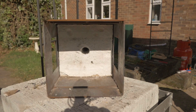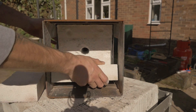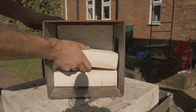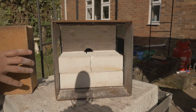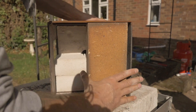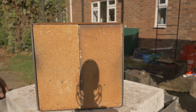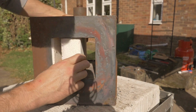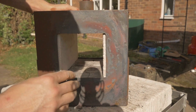The next piece to fit is the two fire retardant bricks that go on to the sides. Here are the two fire retardant bricks — one will go on this side and one on the other side, and as it stands more vertically this one will end up on the top. Now we've got the fire retardant bricks and we're going to add the base bricks, which are also fire retardant but made of a different material. Because these blocks go horizontal, we're going to put these blocks in vertical. As you can see, all of the bricks are now added into the bottom of the furnace. Standing it up vertically, remember to hold on to the bottom otherwise the bricks will fall out, and I'll move one of the fire bricks to the other side. We now have a cavity where the burner comes out — that's where we can start doing our forging.